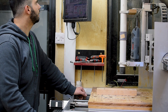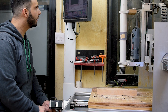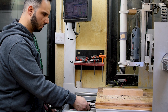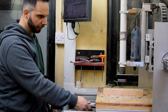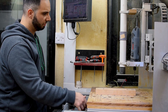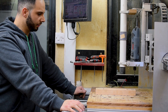I can go up to 2500 millimeters per minute — much faster. Even at 1500 it's much faster, and if I apply pressure it doesn't stall. Obviously if I physically hold the ball screw it will stall, but that's expected. It's a big improvement from before.